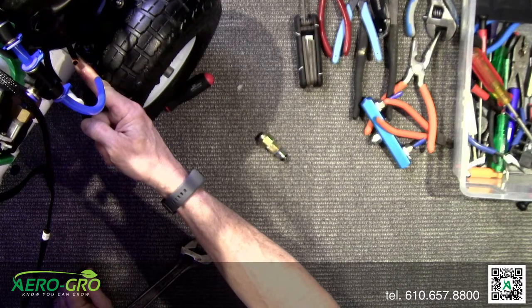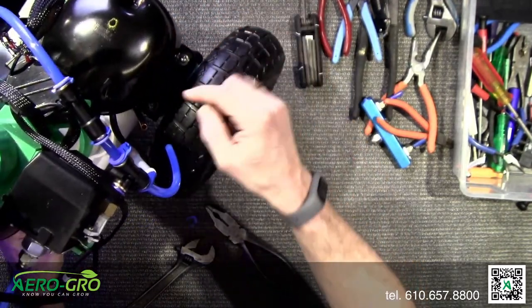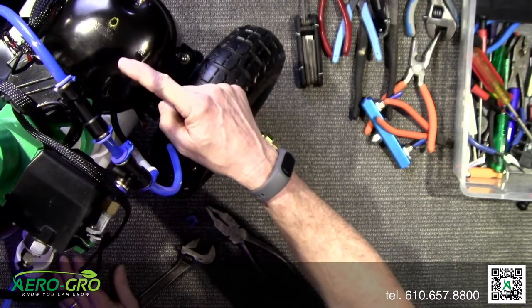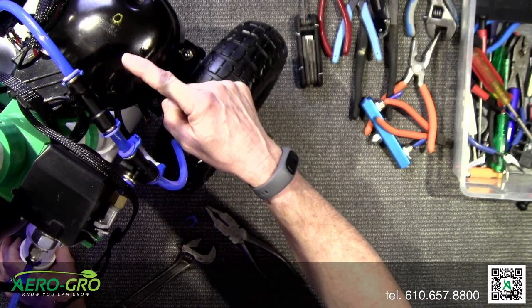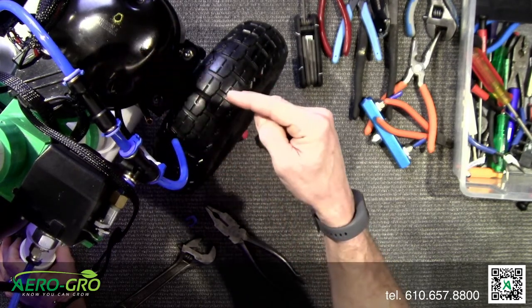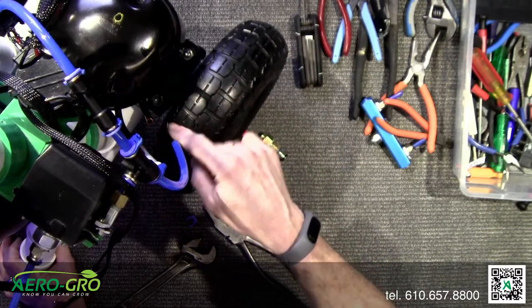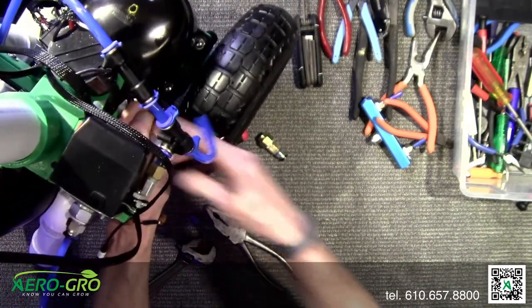And there are actually three tubes on any refrigerator pump. Pull this forward a little bit. One of the tubes is for filling it with Freon at the factory if it's going to be used for a refrigerator. The second tube is to fill it with oil. And the third tube is the output, which is where the air comes out of. So we're taking the cover off of where the air comes out of.